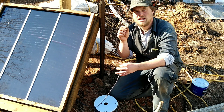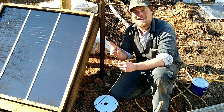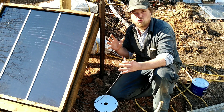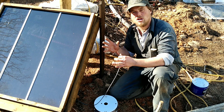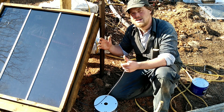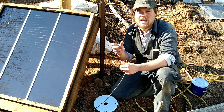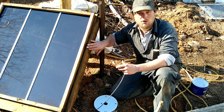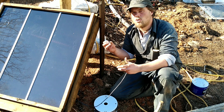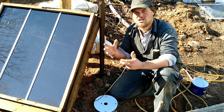It's kind of like Christmas lights — if one light goes out, the entire string dies. So why would you ever do series? The one time it's worthwhile is if you have a long run. If your panels have to travel a long distance to your charge controller and battery, doing them in series lets you use much thinner wire because it's not carrying nearly as many amps. But I'd always wire in parallel — I'd rather buy a bit thicker wire and have a foolproof system than skimp on wire and have a system full of flaws.